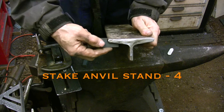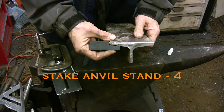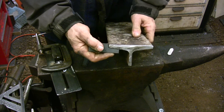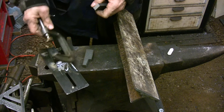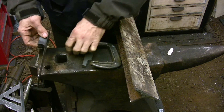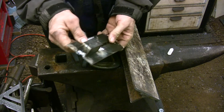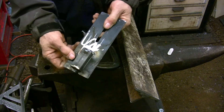The horns are going to be made from three inch pieces of half inch by one inch flat bar, and I've taken a few minutes at the bandsaw to cut the notches that I need to make it fit around the beam. I have a total of 16 of these horns that I need to weld on three separate beams, so I decided it was best to use a setup jig to make sure that everything winds up square and evenly spaced.